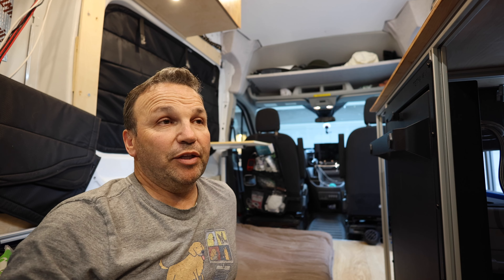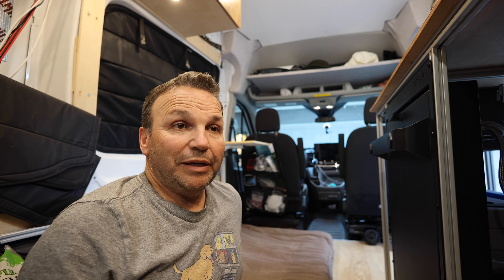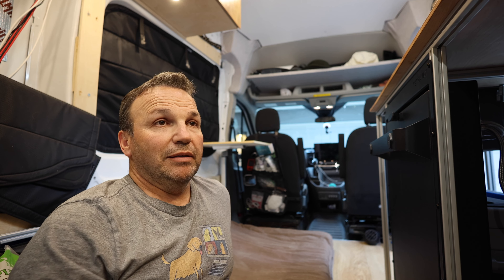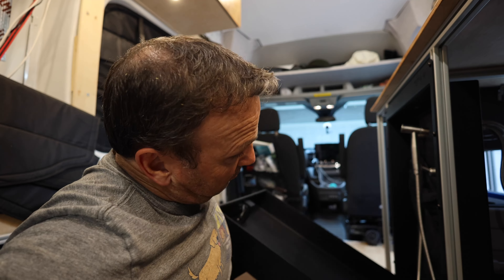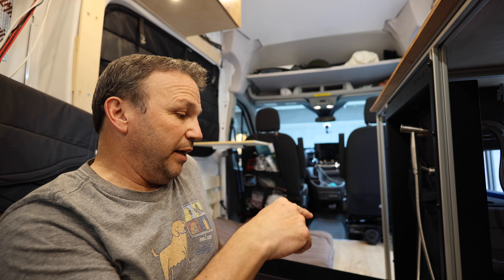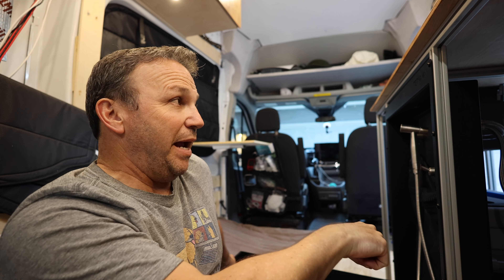The problem is I have two water sources draining: the sink and the shower. For the sink, I decided to use a half-inch line from the bottom of the faucet. I know it's not strictly plumbing-correct, but we're going to be conserving water — we only have 33 gallons. It'll be quick use: wet your toothbrush, brush, wet your face, done. So I made a hole to connect the sink drain to the back of the shower pan.